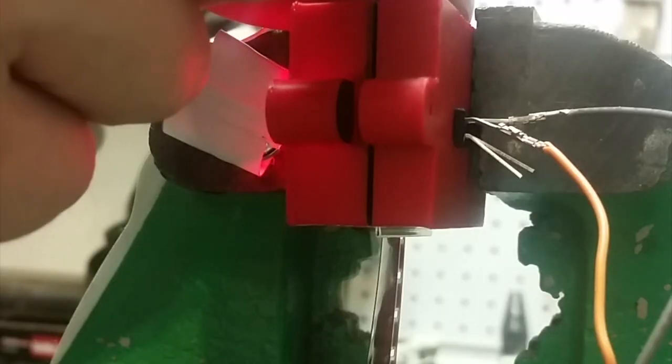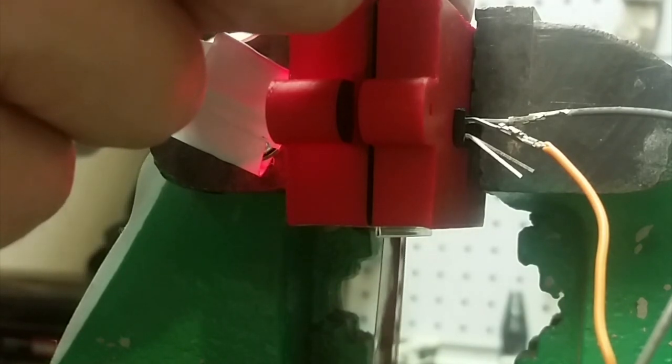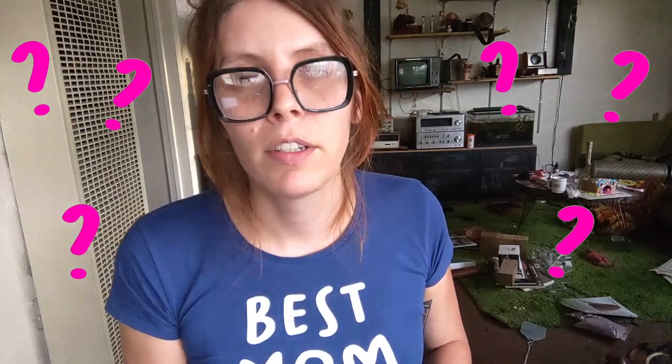Then I tried a photodiode, which worked a little bit better. I actually started to get a little bit of sound coming out of this thing when I pulled the film through it. But it was really, really quiet and very muffled. A friend of mine suggested I try a thing called an OPT-101, which I had never heard of before. It's a kind of trans-impedance amplifier — don't ask me how that works, I'm not an electrical engineer. But in essence, it's a photodiode matched with an op-amp, and they're matched in some way that makes them particularly more sensitive than other kinds of light sensors. So I bought a couple on the internet, wired one up to an amplifier, and I could actually start to make out a human voice.